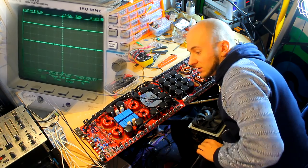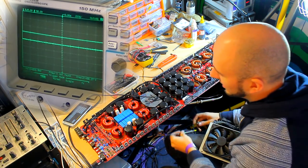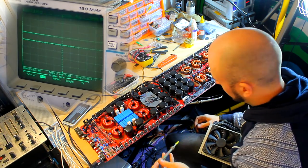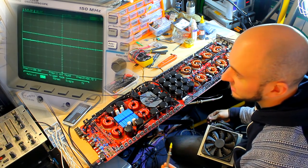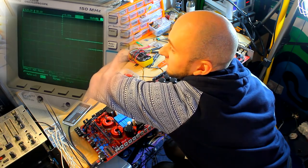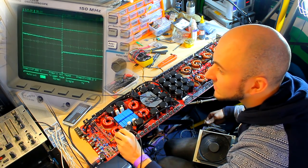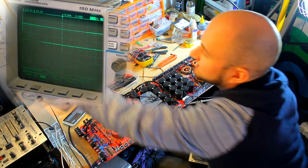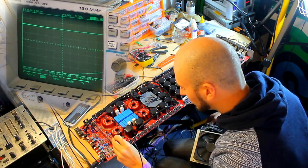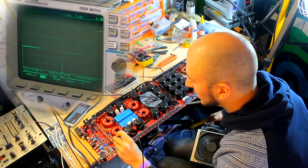So I'm just going to take my RCA leads down here. All right, so we've got our frequency generator here on the phone. I'm just going to go and hit start on a 40 hertz. And let's see whether we have square waves on those ones that didn't before. I will probably actually have to change my scope so we can see 40 hertz nicely. Okay, cool. It's now switched to 40 hertz because we have the input signal. So 40 hertz, that looks okay on drive.